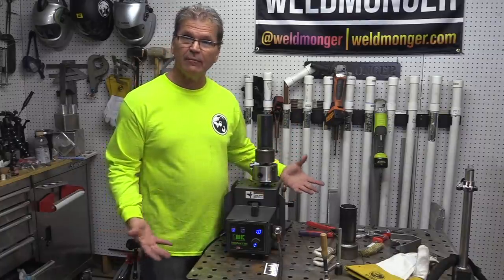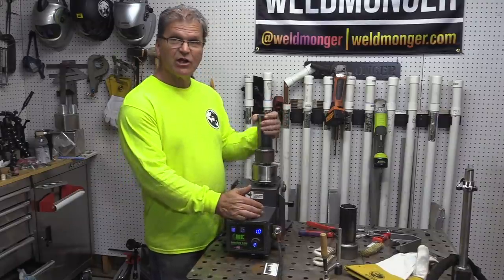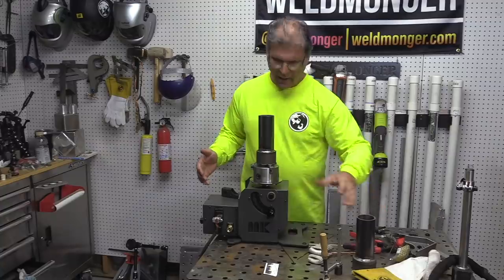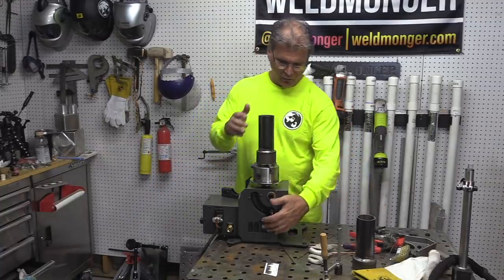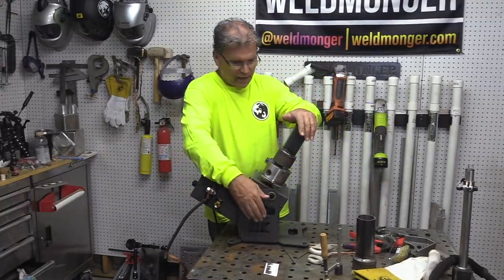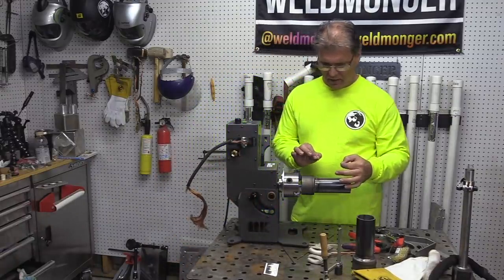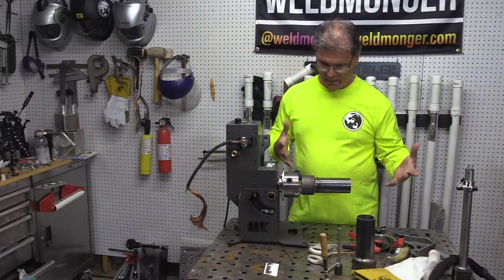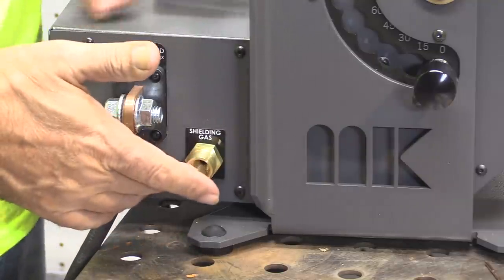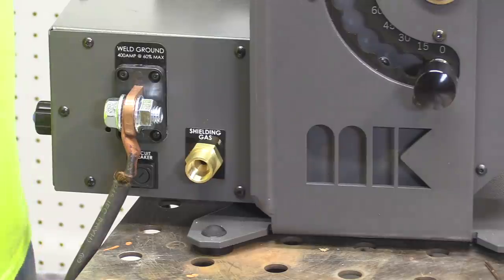The whole reason you're getting a turntable is to save time and increase productivity, so having the clutch is huge. I can also weld at pretty much any angle — I pop the spring-loaded pin and go in 15-degree increments, all the way horizontal if that's more comfortable. There's also an argon port right here where argon comes up through the chuck through a little diffuser screen, which we'll get into later on some stainless.